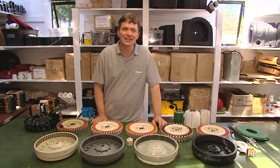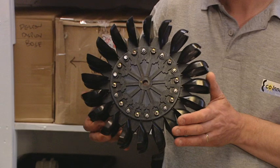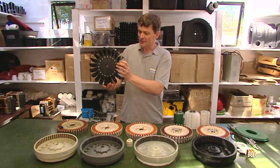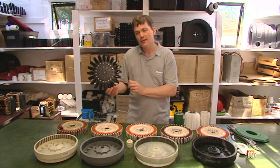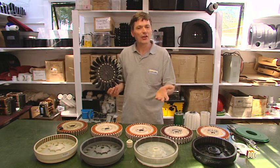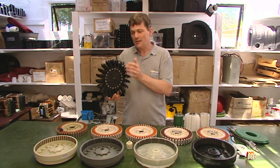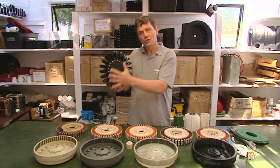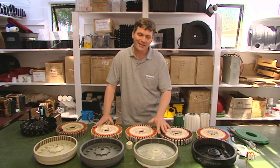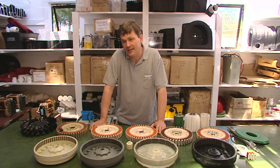Any piece of rotating equipment has two parts: the piece that makes it spin — in the case of a wind turbine that's a propeller, and in the case of a hydro turbine it's typically a Pelton rotor. To produce electricity from a stream, you first need to work out how much energy is available, because you can't generate more power than what's available. You do the numbers — how much energy from the stream, at what speed — and that depends on the Pelton rotor design. You then match that to a suitable Smart Drive that runs at the same speed and produces the same watts at the voltage you want. Over the last 10 years we've written software to make that process easier.